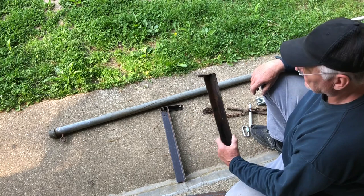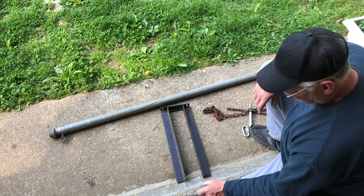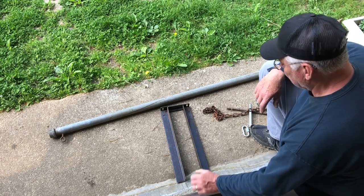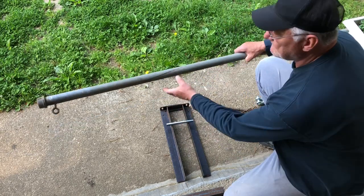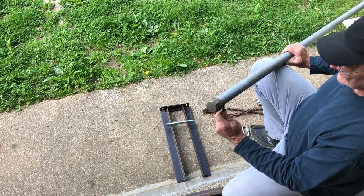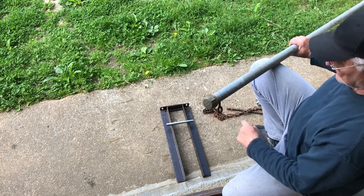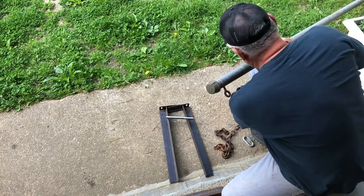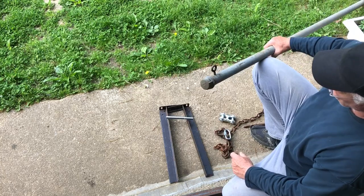This is just some old angle iron that bed frames are made from. I get free bed frames because they usually go in the trash. Another piece of heavier metal for the bottom so I don't have to worry about metal deflection. We'll weld this all together. I'm going to put a pivot point up in here, and this used to be part of a clothesline — real heavy walled, galvanized. I'm going to cut it down maybe four feet or so, drill a hole through here, make my pivot. On the end of this we're going to have a chain that hooks onto this clevis. That's the idea — I hope it works.